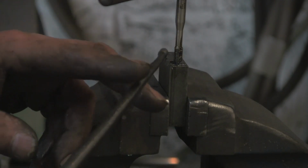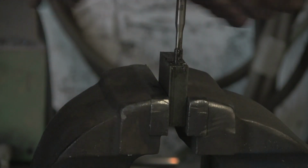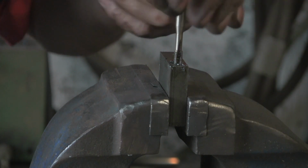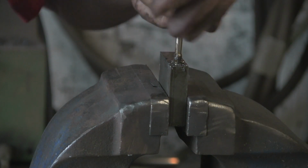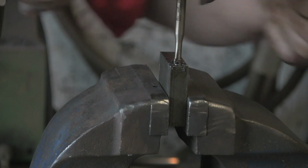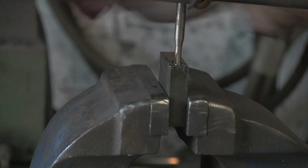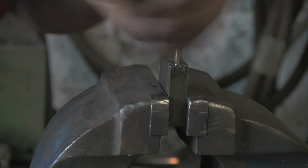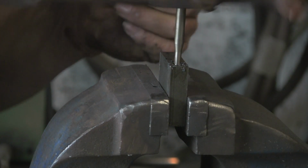Alright, I'm afraid it's a bit dark up this side of the workshop, but I think you'll get the idea. A bit more CT90. And this is only an ordinary straight fluted tap. I generally like spiral point or spiral flute, but this is the only one of these I've got. I don't know where it came from. It's sharp anyway, it's cutting nicely. That's the other thing, this bright bar tends to cut nicely. I'm not sure what grade it is, EN32 or something like that. I don't think it's anything special, it's not hard like an EN8 or 16.